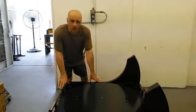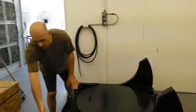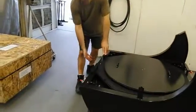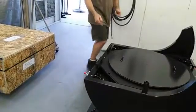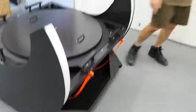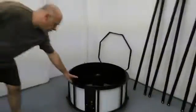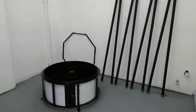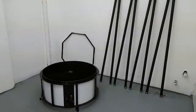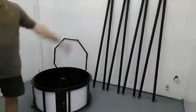The mirror box and rocker box assembly will be together. The axes — both altitude and azimuth — will be engaged. There will be various pieces of cardboard and wrapping that you have to remove from the ground board. Over here, the upper tube assembly will come fully assembled. It's pre-collimated when you get it, so it should be fairly close to collimation. We have the truss spreader and the four trusses.